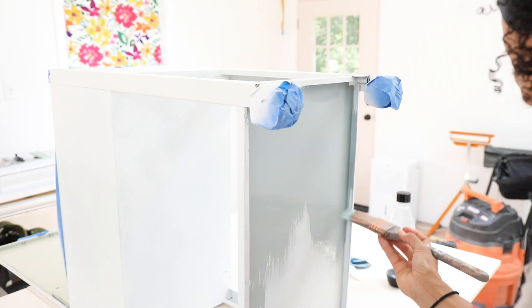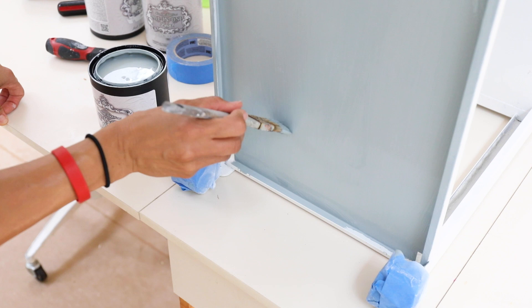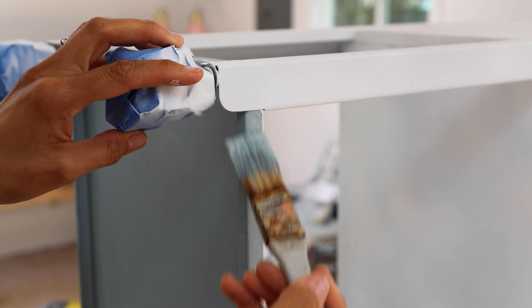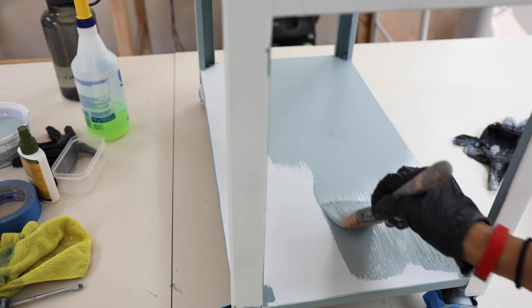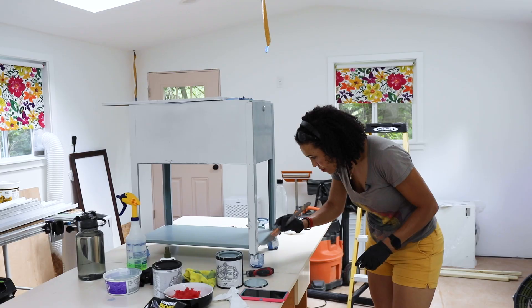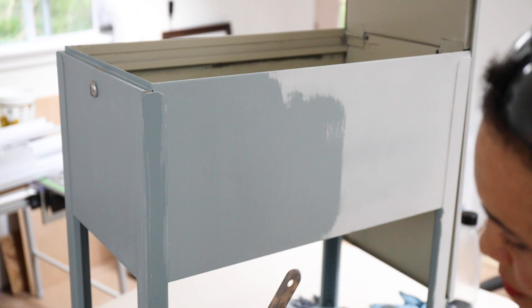You can use a synthetic paintbrush like I did. This particular brand of paint recommends putting it on with a brush and then using a sponge or roller to go over it to get rid of brush strokes. If you're concerned about brush strokes, roll it on or use a sponge for a nice even coat. I actually did two coats, and with the primer as a third coat, I felt this was really even and looked great. If you're not using primer, you might need more than two coats — it really depends on the color and material underneath.